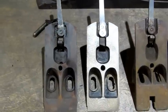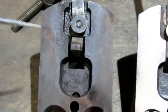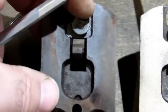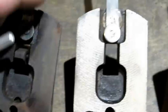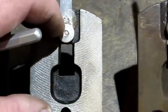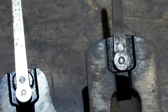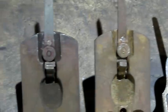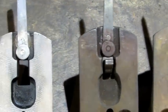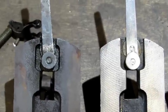There is one last thing worth mentioning — the washer right there on the laterals, this round circular piece. Some of those you will see will turn and most of them won't. The Bedrock is tight. Tight or loose does not make a difference — it's going to work just fine — but if one of those falls off you're going to have to reset that pin just like we did the pin for the lateral.